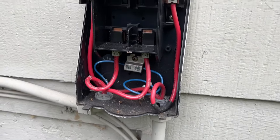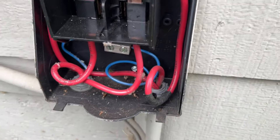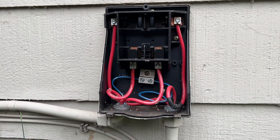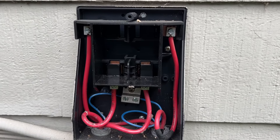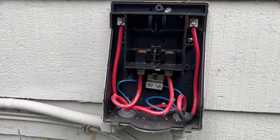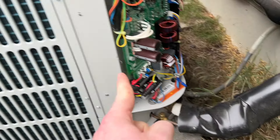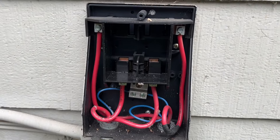So I got the cover off, and I also took the cover off this thing — boy, it's like a whole computer in there. I put the fuses back in just to see if the little display would light up, because it's usually lit up when there's power, and there is none — so that's good. Here's our box. We have a wire here that someone taped up, because they must have pinched it or something. Probably the simplest box you've seen for one of these things. Looks like the blue one is our neutral. This one is a line coming from that way, and this goes to our unit itself, so we can just tell by process of elimination which goes where.